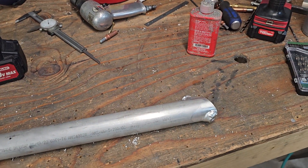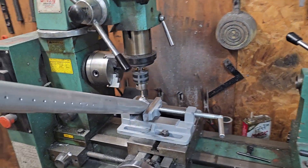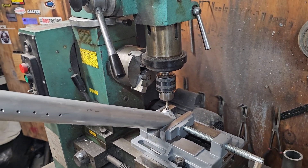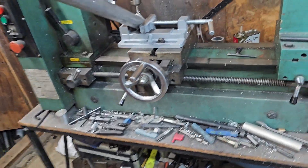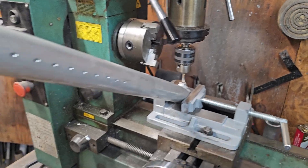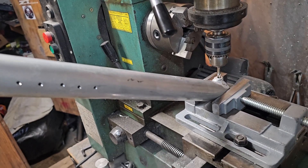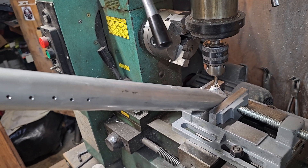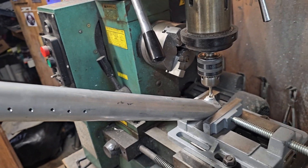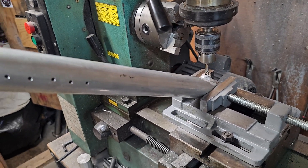This is crude but effective. I hadn't used the mill since I drilled that on the original one — I just used an angle finder, found the angle according to the plans, drilled through it, and it was really close. Just had to tweak it a little bit to get the angle perfect when it was on the plane. So I just put this one back in there, run the drill bit through to hold it in place, measure the angle with the angle finder, put the new piece in at the same angle, and go to drilling.